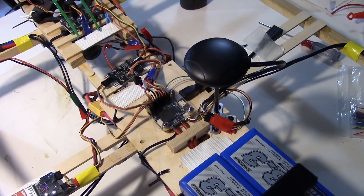Anyway, what did you think about that flight? My opinion about the wobble I got in position hold is that it's either the compass still not calibrated right — which I've done several times — or there's some setting in the CLI I can do to reduce noise, or maybe there's another issue altogether with the settings. This is the Omnibus F4 V2.1 with iNav Cleanflight — not version 1, 2, or 3, this is another kind I got from Banggood. It seems to work pretty good other than that little wobble, and I think that's something I can work out. Let me know what you think — talk to you later.